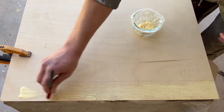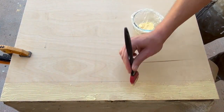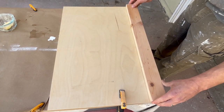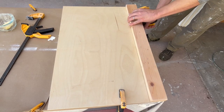Using this method and tools, a small cabinet door will cost you just about five dollars or even less, and for a large cabinet door you will be able to build one for just about ten dollars. First, glue up one of the stiles, and then I recommend gluing up the rails and the other stile only after you dry-fit them first to make sure they're at perfect length.